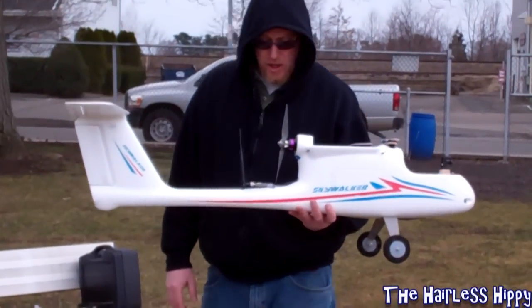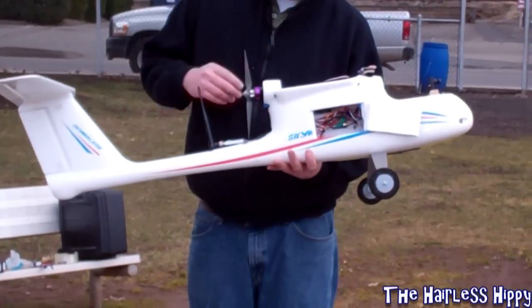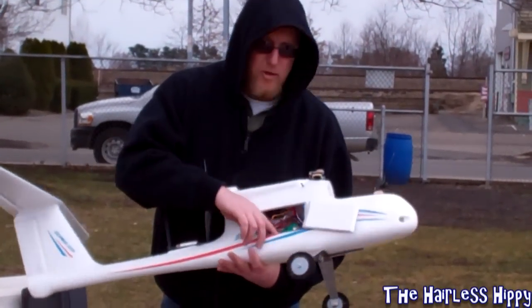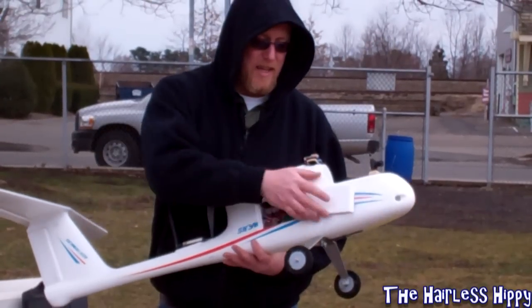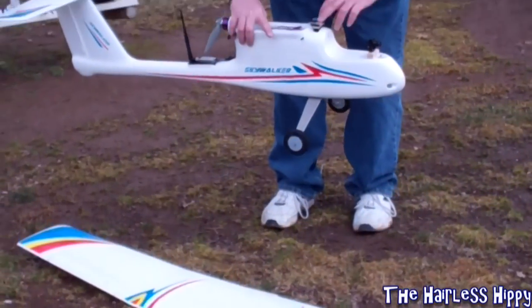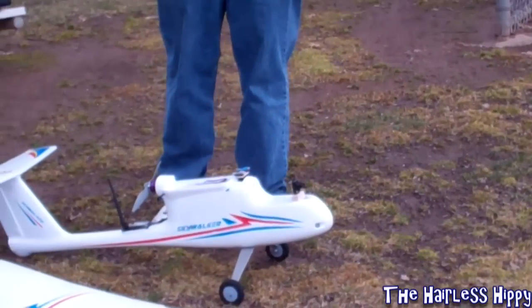What we have here — I'm just going to go real quickly — is we have a 1.3 gigahertz video system in here. And we're using a Chainlink UHF long distance transmitter receiver that I connect to my DX8 transmitter. We also have the FY21AP, which is the autopilot. And I believe it's the CEOSD that we're going to be using. We have two GPS's on top and we have a video camera in the front that's going to show me the whole flight.